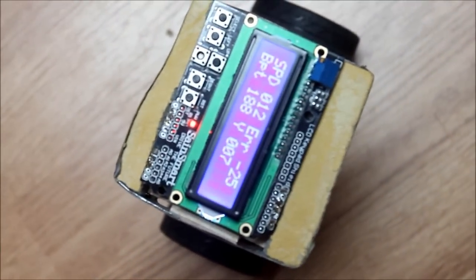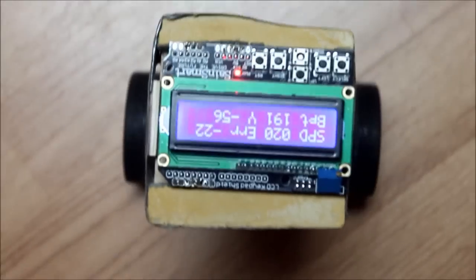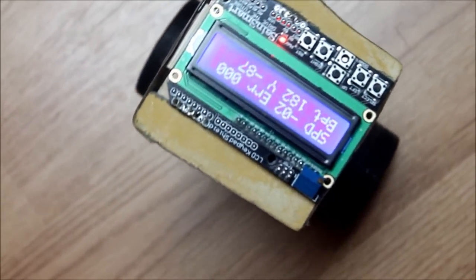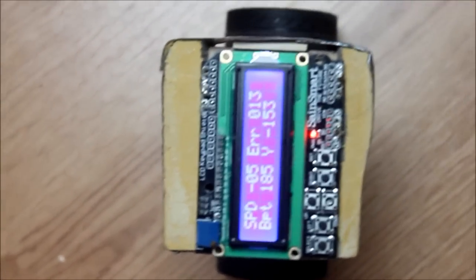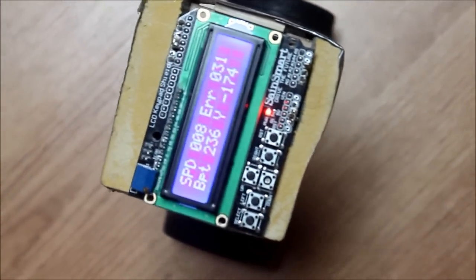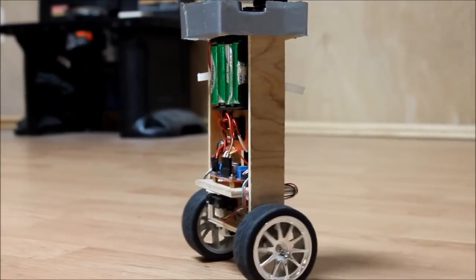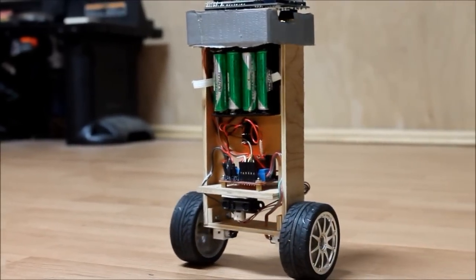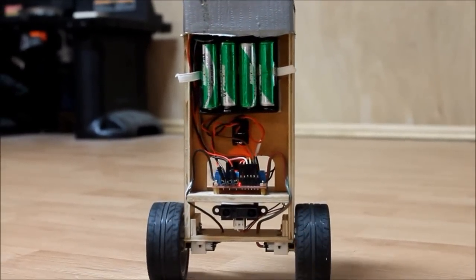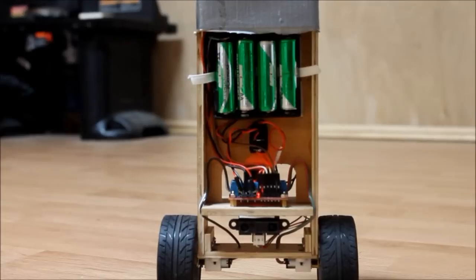The other thing about this car's display worth pointing out is that in the previous versions, the LCD 4-bit mod library was used. This was driven mostly by my having selected a SainSmart display and looking to their website for examples. But because PID refresh rates are critical to making a car like this work, I quickly learned that updating the display was getting in the way — depending on which character positions were involved, it would take anywhere from 25 to 125 milliseconds. It was mostly by accident that I found using the LiquidCrystal library alone yielded four-millisecond processing times, irrespective of which portion of the display was being updated. From the perspective of using the display, this was a major find.